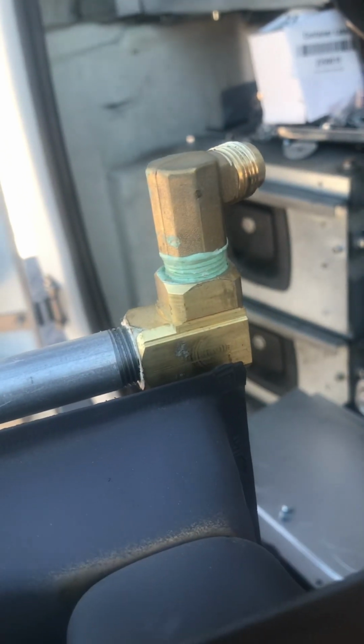And I look, and like I said, this is propane line in, well sealed. You can see sealant on that. Comes in, I can see something on that I would suspect is sealant. But then when I get over here from the output to there, this is where my bet is going to be, because I've never seen that this leaks. My bet is going to be that right there after the solenoid, that either that's not tight, or I'm going to put thread sealer on it anyway, but that is where the suspect is.